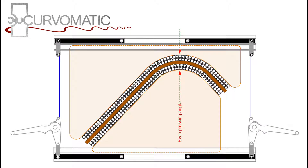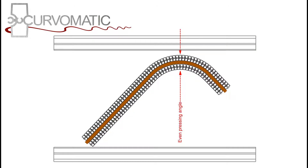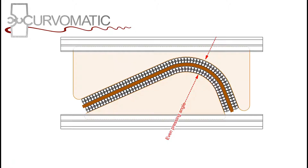With two-part molds, design your formers so that pressure is distributed evenly through the pressing surfaces. For this L-shape example, set up with the pressing surfaces at 45 degrees so the pressure acts on both surfaces equally. To reduce the size of the formers you can also clamp at an angle to the forward beams. The clamps must run parallel to the even pressing angle.